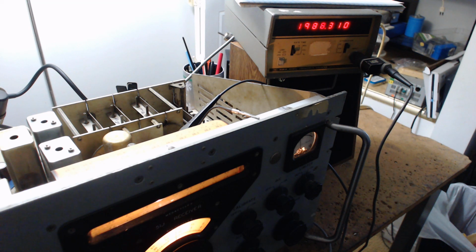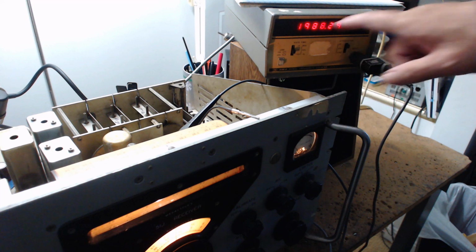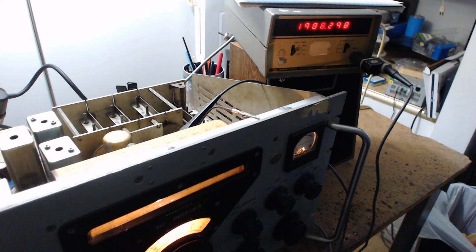But I'm trying to do something different. Whenever I notice, this radio is totally different. No matter what band you turn this radio to, this thing goes between 3 megahertz down to 2, because what you're dealing with is a frequency range that has been changed by mixers to get down in frequency. And the reason they did that is the local oscillator, which is called a PTO, drifts less when you work with a lower frequency.